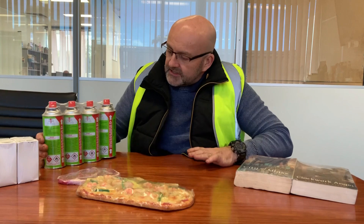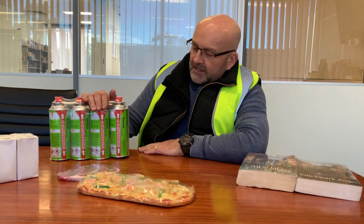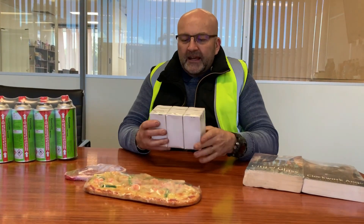There are other things you'll see on the market, such as these gas bottles, where you've got say four gas bottles put together with this sort of product. I generally use a 25 micron film for that, because the product is going to get a lot of movement around it and the thicker the film the more stability you get.